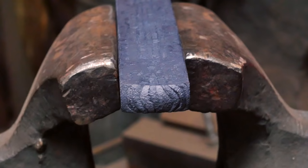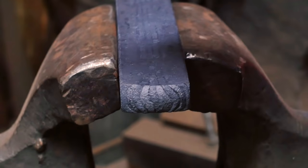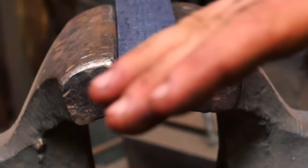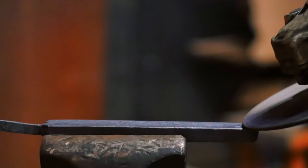Right now you can really clearly see the different patterns, not so much because it's delaminating, but just because the carbon steel and the nickel steel, the 15 and 20, both oxidize in different ways. And this is a great way to see how you're developing it. What I'm gonna do right now is I've got it in the vise, I'm gonna take a big grinder and polish off the top surfaces, and then we're gonna hack it up into a bunch of pieces and stack it up.